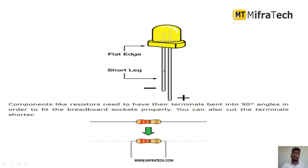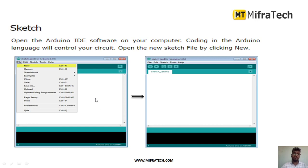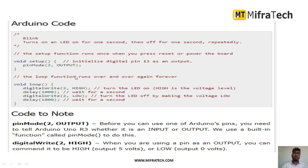This is how the LED looks: the short leg is the negative pin and the long leg is the positive pin. Now we will write the program. Open a new sketch. In the void setup function, define the pin mode — since the LED is connected to pin number 2, set pinMode 2 as OUTPUT. In the loop function, write the actual logic: digitalWrite 2 HIGH to turn on the LED, then a 1000 millisecond (1 second) delay, then make it LOW again to turn off the LED.